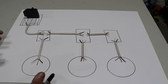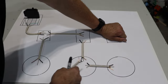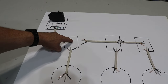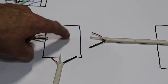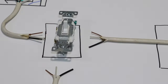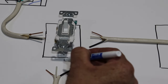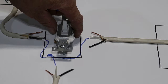People have asked how to hook up lights. You can certainly hook up lights one right after the other from a switch — you're going to wire the lights together and one switch is going to control them. So let's take a look at this first switch box. Right now we have three different Romex wires coming into this switch box. Think about what each wire did in the first simple light circuit example. All of the white neutral wires were connected together, so what you can do is take all of your white neutral wires and connect those together.